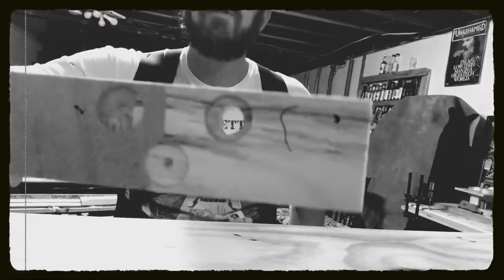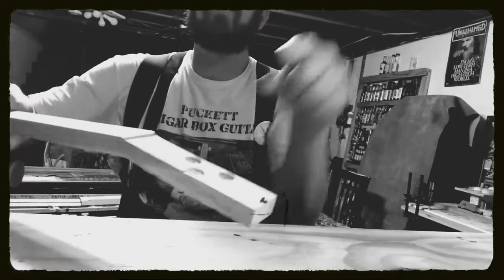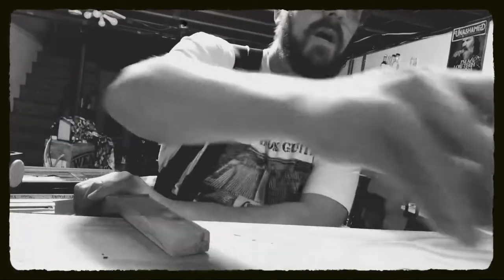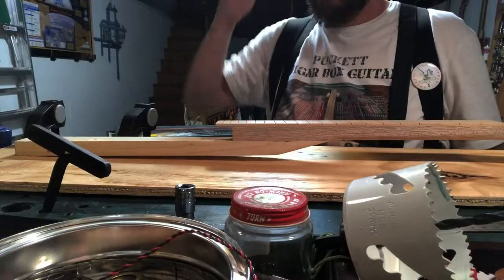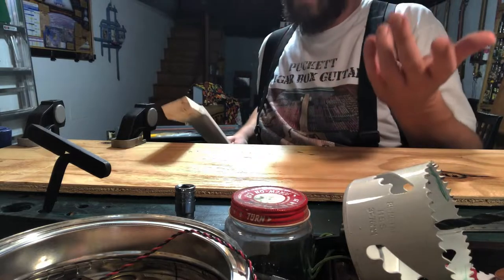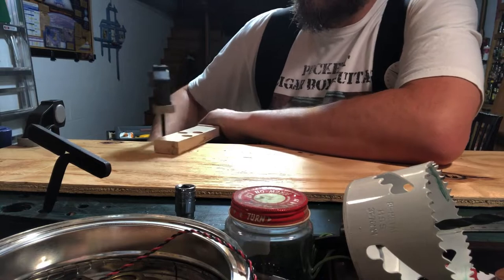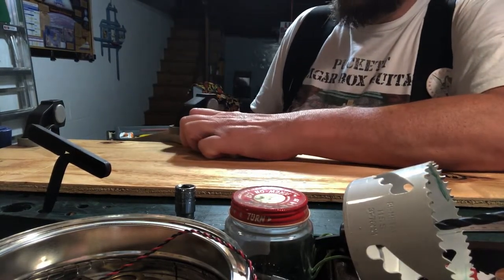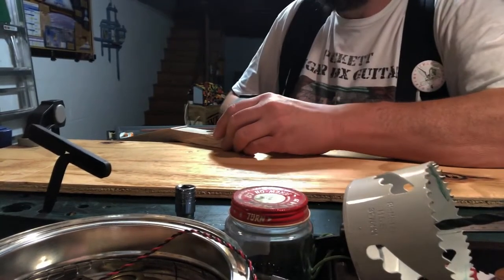Blam, look. So I've pre-drilled those with that 5/8. Now I'm just going to go all the way through. You know how to do this. When you're drilling holes, put a piece of wood beneath. I mean, you don't have to. The Emerald workbench can take it, but I'm trying not to put a gazillion holes in it. Take your El Clampo, clamp this thing down. Something like that.